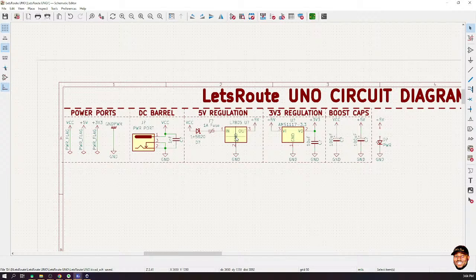So, listen, this is what we are doing here, okay? This board we are designing will not even inherently pull more than 600 milliamps. This polyfuse is just there in the case of a short circuit. And just to be very fair, I'm limiting that to 1 amp. If in your application you think your system wouldn't even get to 300 milliamps, you see, there is no generic system. You are always designing for what's your load intent. So there shouldn't be like, oh, I saw this here, I saw that here. You don't know what the person intended to do.